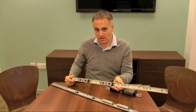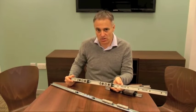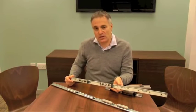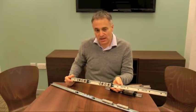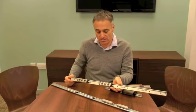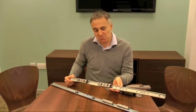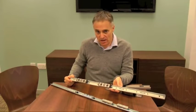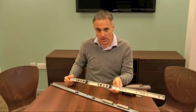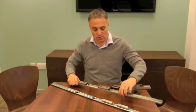The Compact Rail system has some major advantages compared to linear guideways. The most important is that unlike monorails and guideways, this system can take some degree of misalignment because it has a master rail and a slave rail system. I would use this where you need a degree of accuracy, you need to take some heavy loads, and also you need to account for some moment loads. The Compact Rail system is probably one of the best products that we've got on offer.